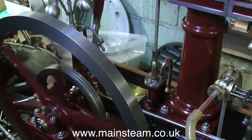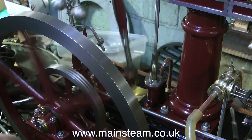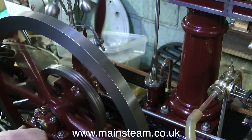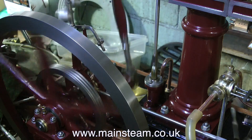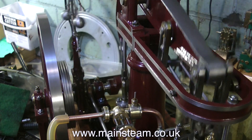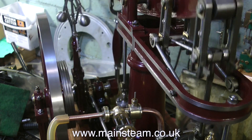The final episode will show the finished product as close as I can get it, plus I'll show you what I did with the corners of the brickwork. Valve timing on the steam engine is very, very important. Early admission is the best way to go. Most steam engines use late admission and the flywheel limps over top dead centre and then gets a kick on its way by the admitted steam. You can hear that the timing is out by the noise that the engine makes.